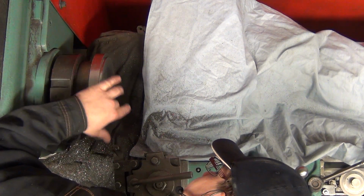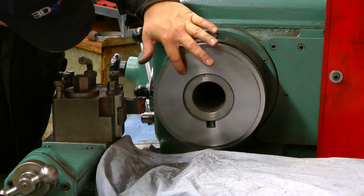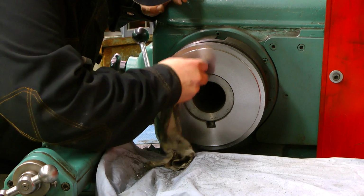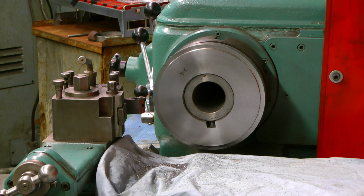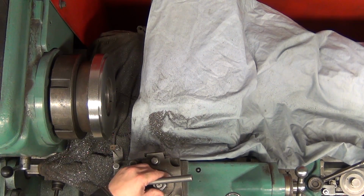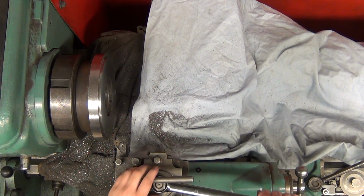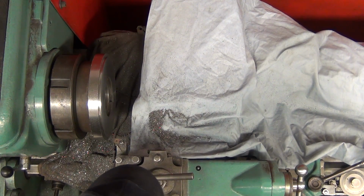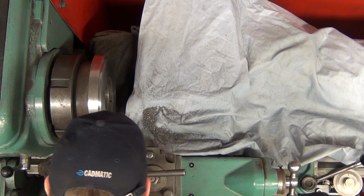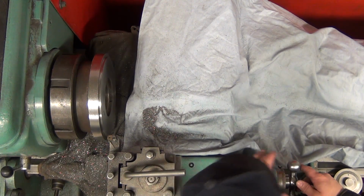Okay, the surface is good in general, and there is a little porous, but I don't think we will do anything about it. We'll leave that, and we will again readjust our tool. So we will just touch the surface and then we will have a new 0, and I will again adjust this 0 as well.